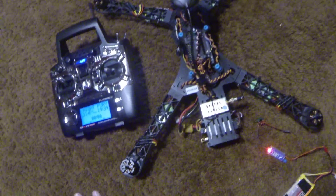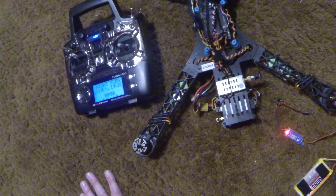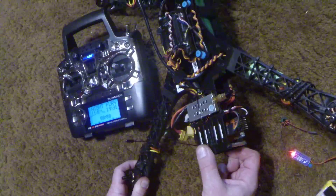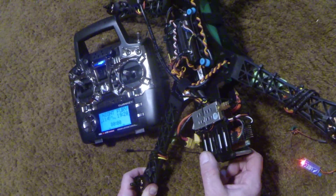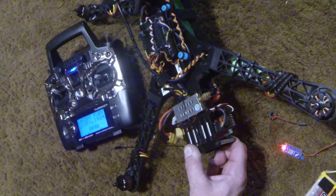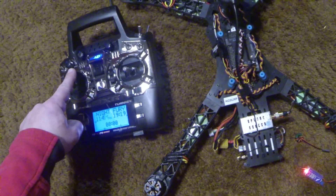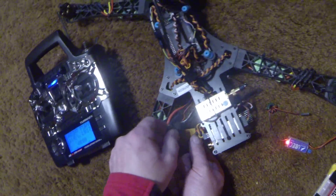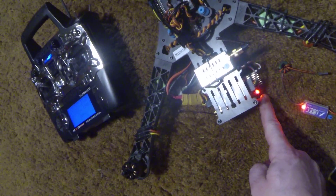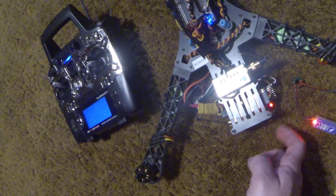This is how you do an ESC calibration when you have an APM 2.6 and you're using the single wire coming off of an EzUHF or something like that using a muxed output. The problem is you get the throttle all the way up just like it says to do when you plug it in, but it doesn't link up fast enough — now it's linked, but by the time it gets a full throttle signal to the APM it's already powered up, so it's just too late.